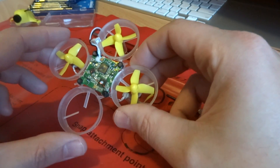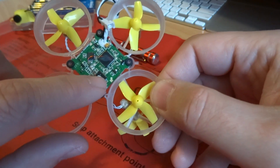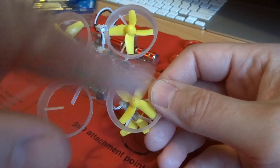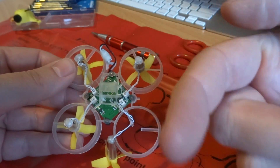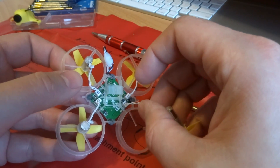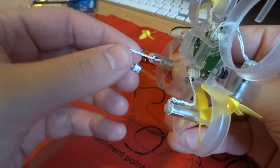When doing this I have to be aware of which motors go in which direction. Here's the front arrow of the PCB — this is the front. The motors rotate in different directions so I'll keep everything where it's supposed to be. I'm going to start by taking the motors out, flipping it 180 degrees laterally while keeping the front pointed towards me. The motors just unplug — this is nice, the whole upgrade should take no soldering unless you want to upgrade the wire. Be careful that your wiring slips up and around through the holes.